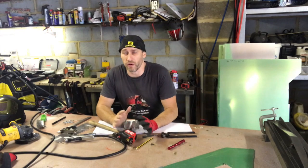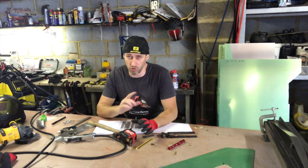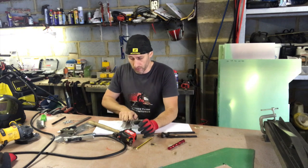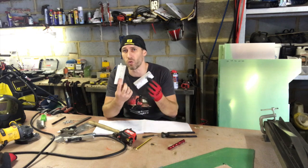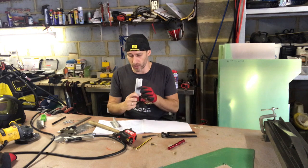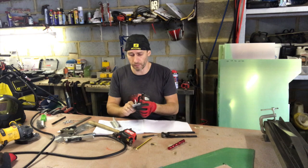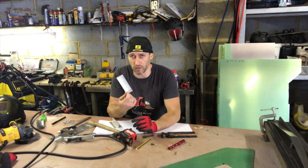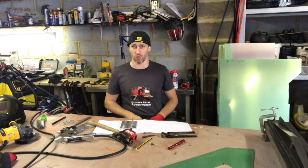So I've put the woodwork to the side for now. I've done as much as I can on that. Once that's in place in the truck, I'll then make some decisions on other bits and we'll build those. So I've gone back to welding. I've just made some brackets to put the snorkel on that I made a few weeks ago. I just welded up some bits of aluminium bar. Now we're going to put in some holes, countersink the screws, and then we're going to paint these, glue and screw to the front of the truck, and we can put the snorkel on.